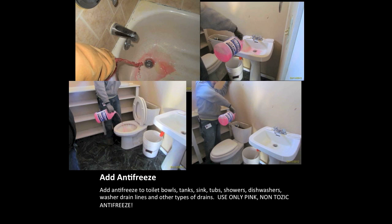The after shot of the toilet must show a clear pink liquid in the bottom of the toilet. Do not pour antifreeze in a toilet that still has water in it, because the antifreeze will show as a more clear liquid rather than pink. Our clients are looking for a solid pink liquid in the bottom of each toilet. Please make sure that non-toxic pink RV antifreeze is used. Do not use green car antifreeze, and do not dilute the pink antifreeze with water — we can tell from pictures when it has been diluted.